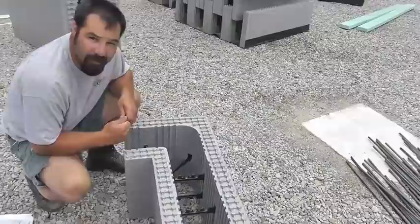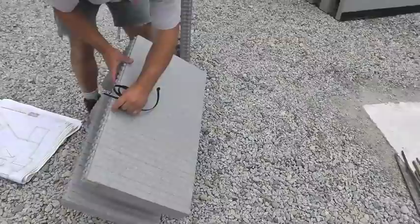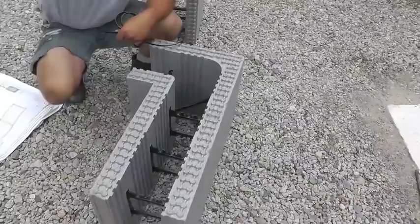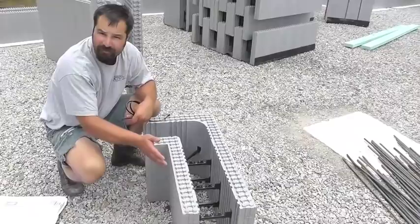The corner here is thickened up on the outer edge and there is internal webbing that braces that. This internal web also incorporates a plastic stud every eight inches. So if you were to go above grade or to finish off your basement, it's ready for sheetrock immediately. There's no strapping required. You can sheetrock the inside or put cultured stone right over the styrofoam block.